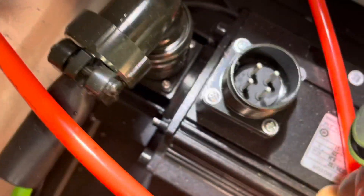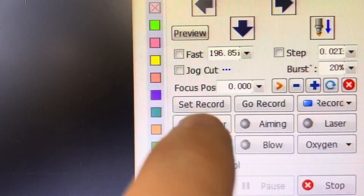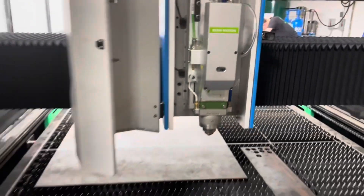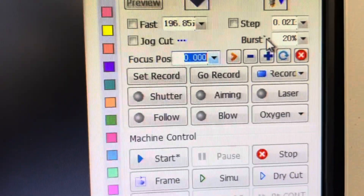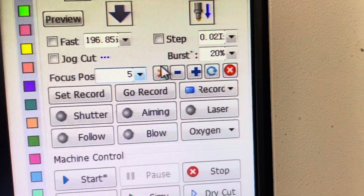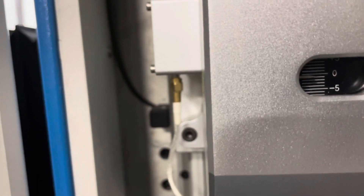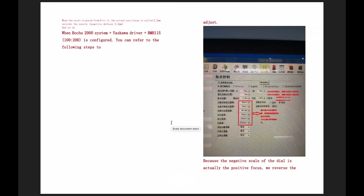Here's a look at the tube cutter making the final connections on it. We had a couple of problems on this one — one was related to the focus. If you dialed in a specific focus, the dial in the laser head was not responding in the normal way. Normally if you specify, say, positive five focus and tell it to go to positive five, the autofocus servo inside the laser head would take you there. But it was responding in a negative way when you told it to go positive.